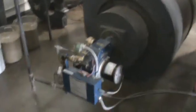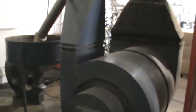from one burner. A lot of roasters use a 2-burner setup where they have one at the roaster and one on what's called the afterburner, which is this chamber back here. We utilize just an enlarged burner on the afterburner. It allows us to run more efficiently. We burn about 30 to 40% less natural gas than a standard roaster on the market right now.